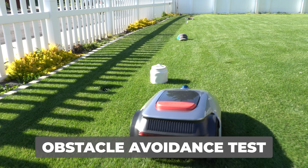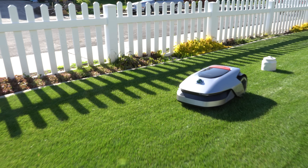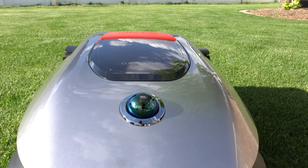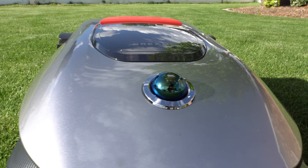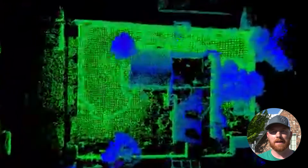The obstacle avoidance is built to sense objects with a working height of 4 inches or higher — you can dial it a bit lower, but for the most part it senses obstacles 4 inches and above. When Dream claimed the LiDAR was capable of mapping up to 70 meters from the tiny LiDAR on the front of the mower, I thought it was a little far-fetched. But you can actually see a 3D map of your property through the app — I can even see details of my neighbor's yard across the street — which shows the LiDAR is super functional and not just a marketing gimmick.